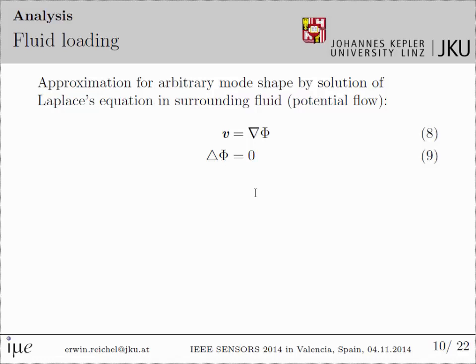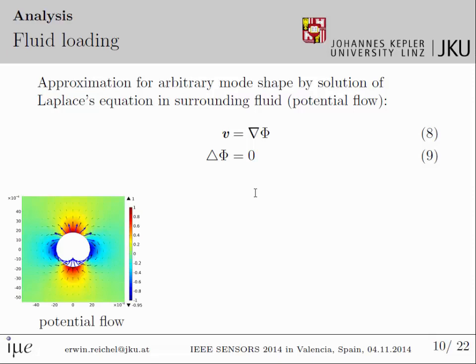For the velocity, you solve only one scalar equation — the flow potential. The equation to solve is just the Laplace equation with appropriate boundary conditions that come from the mode shape. In the case of a cylindrical cross-section, one property of this potential flow solution is that you can only prescribe the normal component of the flow velocity, but the tangential component, which is determined by the no-slip condition, usually cannot be fulfilled by the potential flow solution.